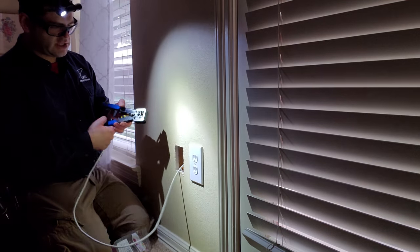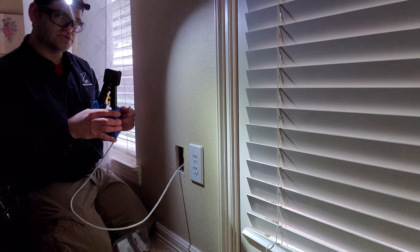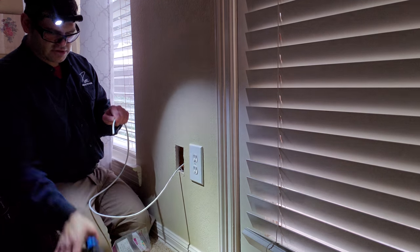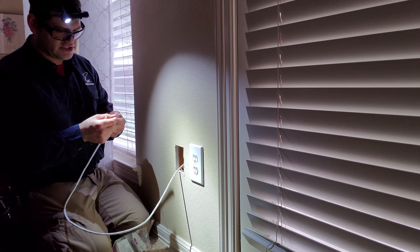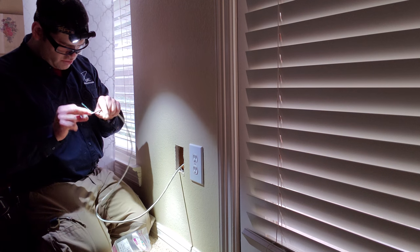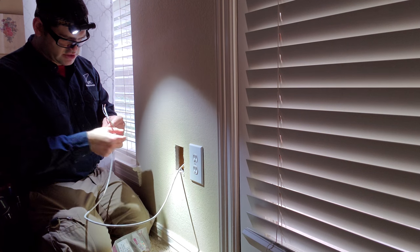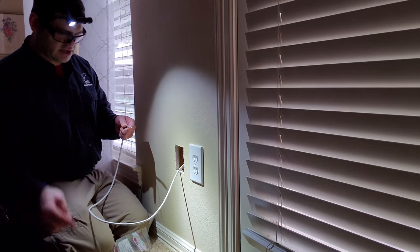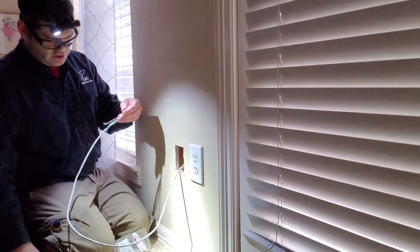So we also use the EZ-RJ-PRO-HD from Platinum Tools. This is a crimper as well as a stripper for their EZ crimper male connectors. So we always do check to make sure that we don't overstrip it, because it can happen, stuff happens. When you use the same cable over and over again, same length of cable, you get pretty good at knowing how far in to go.